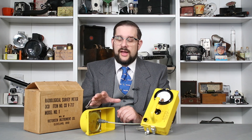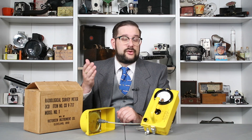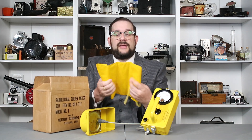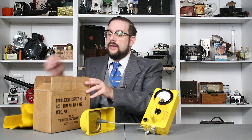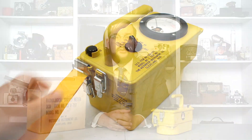One of the potential flaws with this design was that the lower casing and the ion chamber could accumulate fallout particles, meaning that readings could be thrown off and that you'd have to decontaminate the unit. For this reason, the 717 was issued with a plastic anti-contamination bag which fit over the lower casing, preventing fallout from getting in while providing no barrier at all to gamma rays entering the ion chamber. The box also came with an instruction manual and a shoulder strap which attaches to lugs on the front and back of the unit.